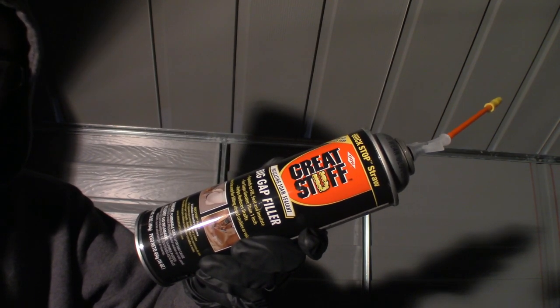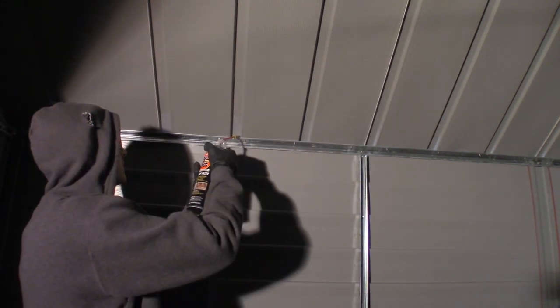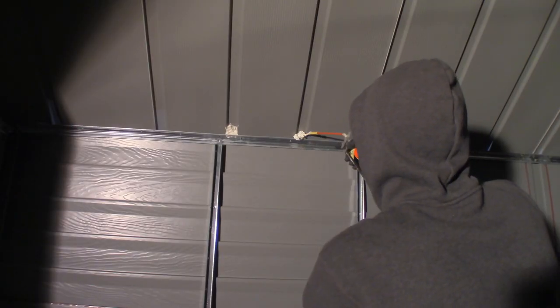Let's see the results on our door with a light test. We'll go ahead and close it up. Now — no more light. So that's a good sign, but now we have some other spaces to fill. This here is called Great Stuff, and it's the big gap filler version. Open the straw, shake it up for a minute, and make sure you're covered up and being safe. When using it, pull the trigger in quick single bursts because it puts out quite a bit. Do this where there are any large gaps that need to be filled. All that marshmallow-y looking stuff is where we used Great Stuff. It took about two or three cans to finish it all up — we filled up corners, notches, and even spaces on the ceiling.